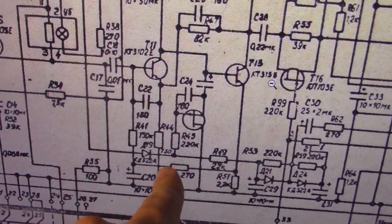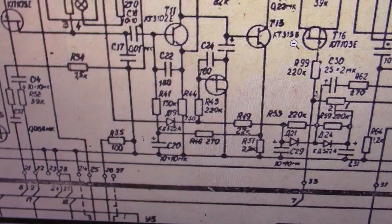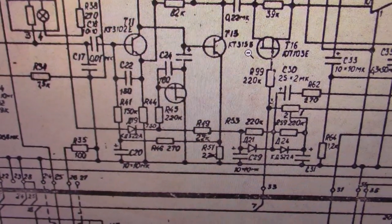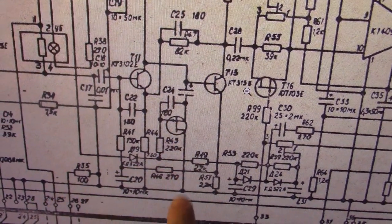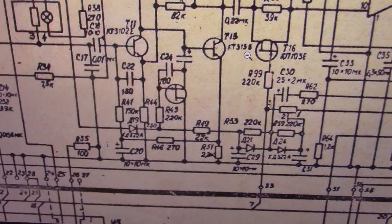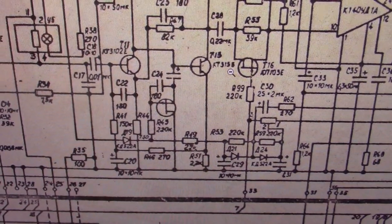So I put a meter on this gate here, and I'm getting a voltage corresponding to the audio. The louder I would talk through the microphone, the lower the voltage was. Being a P channel, if you ground the input, it'll turn it on. So basically, you need a very low level. The lower the voltage is, or the closer it is to ground, the more this turns on. But the voltage was not decreasing enough to actually turn the transistor on. So the transistor was never actually turning on and never actually bringing this capacitor to ground to lower the recording level.